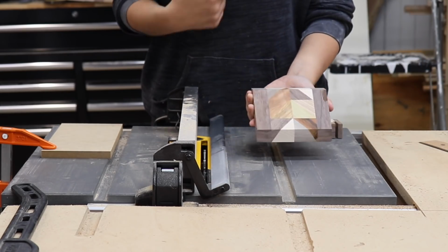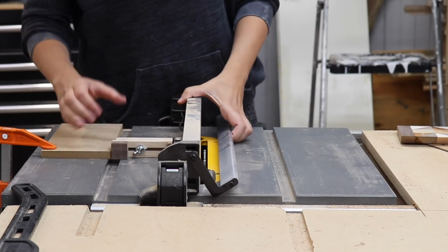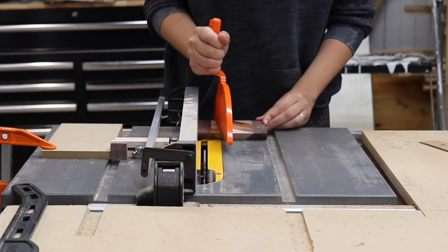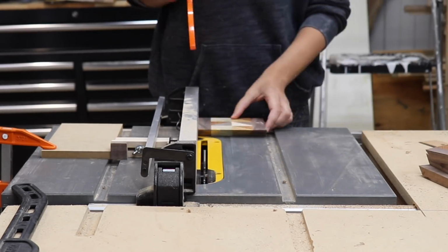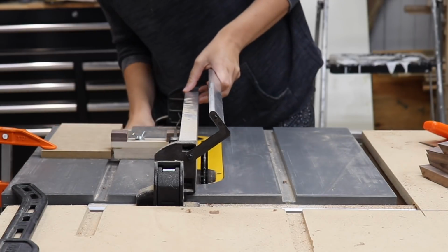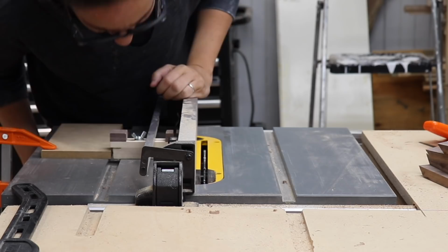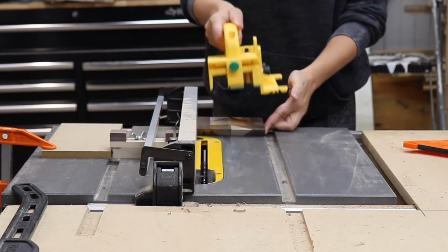Alright, moving on, I totally forgot to make the grooves on these side pieces before cutting them up, but I did remember to use my kerf maker this time, which made the process for getting the correct width a bit easier. I made one pass about a 1/4 inch up from the bottom of all the pieces, and then flipped my kerf maker over to adjust the fence and made a second pass on all the pieces to make a perfect fitting groove for the plywood bottom.